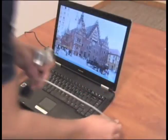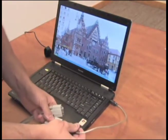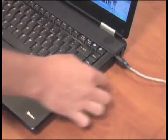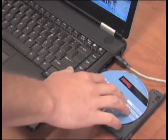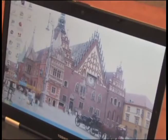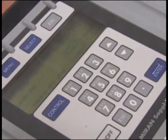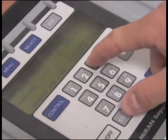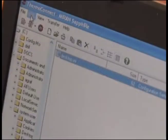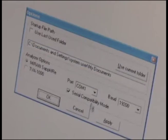Attach the data log cable to the PC with or without the USB converter cable. Open the side panel on the unit to connect the data log cable to the unit. Install the software CD on your PC. For a non-spectrum scan survey, open the software Thermo Connect and select 5, Report, from the main menu of the unit. Select 3, Data Transfer, then select 3 again, Send Receive. From the PC, select Edit Options from the toolbar. Choose Instrument, Comport, and Baud Rate of 19200. Then click OK.